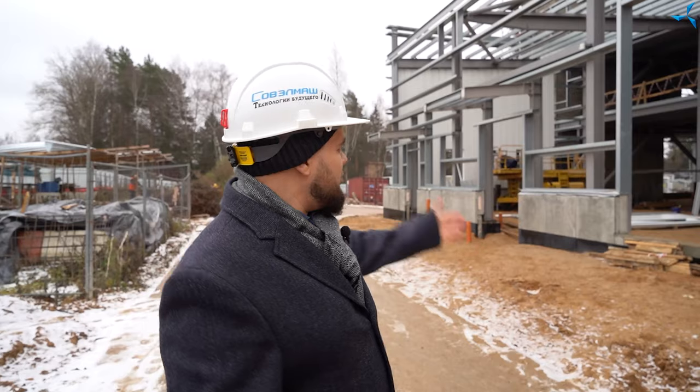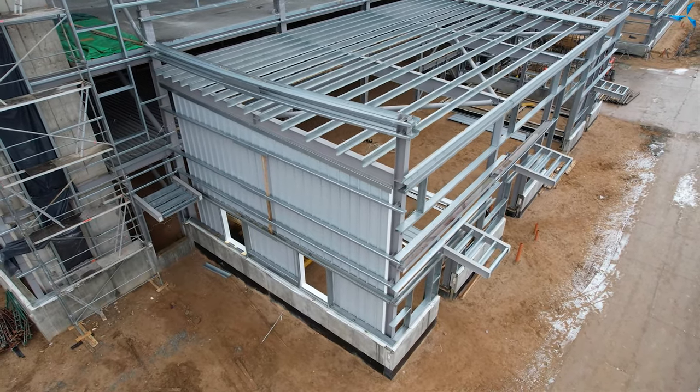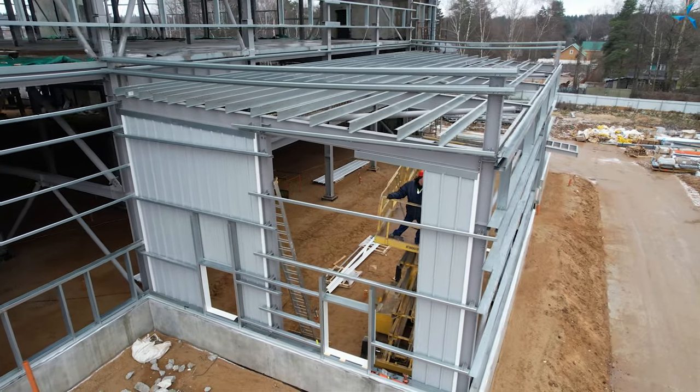Here you see what it is — here you see what makes this day very important. Today mounting of these barriers, these enclosing constructions, has begun. They are the interior parts of walls. These are sandwich panels which will comprise the exterior part and the interior part, and mounting has begun. Now with time you will see the results — how the contour of the building, how the perimeter of the building will be closed. And the presence of these barriers will assure minimizing heat removal because there won't be wind and the metal constructions won't get cold, and concrete will become harder and harder.